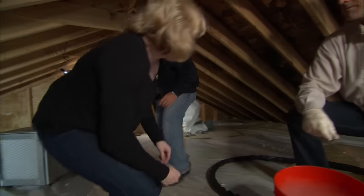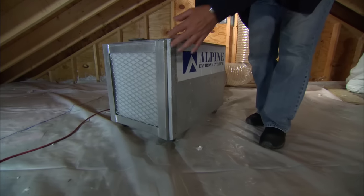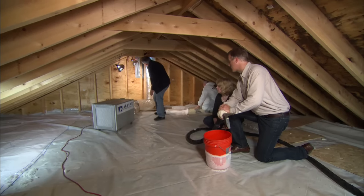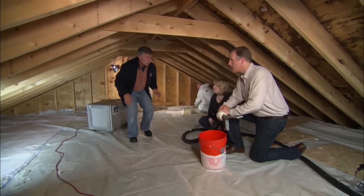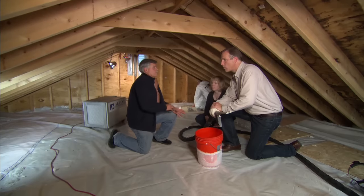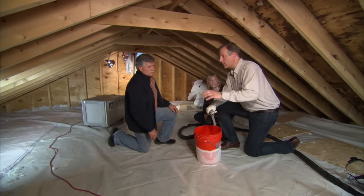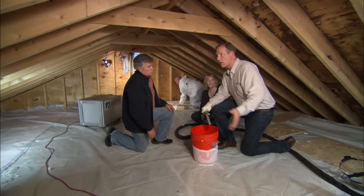It's pretty clean but it does create some dust — that's why there's a lot of plastic down. That also explains the negative air machine here, which takes the dust through a HEPA filter, cleaning the air so when it exits the building through the gable vent it will exit as clean air. A lot of the preparation time is spent making sure the mold dust doesn't get back down into the living space. Once that's done and everything is ready, it moves right along.